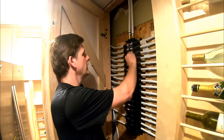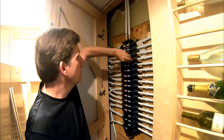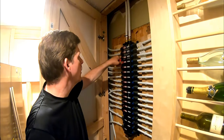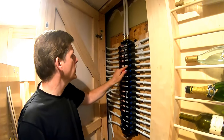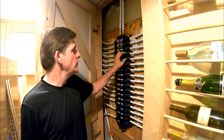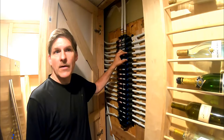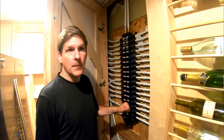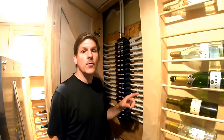This is our Viega ManaBlock. It individually controls the hot and cold water for each outlet. We're turning the hot water off on shower one and shower two, and the cold water off on shower one and shower two as well. If you don't have an individual setup, you'll have a main whole-house shutoff and you can use that — but you've got to make sure the water to your shower is turned off before proceeding.